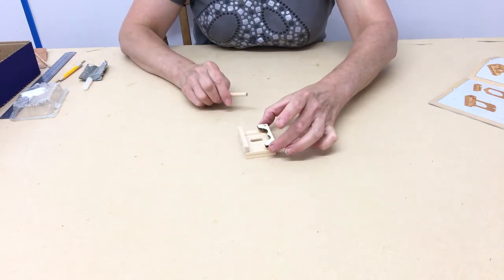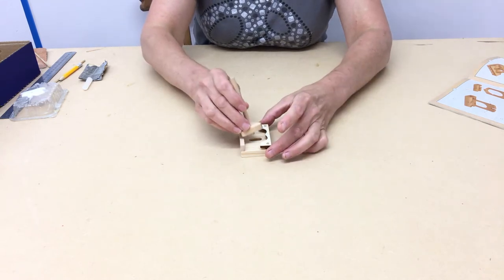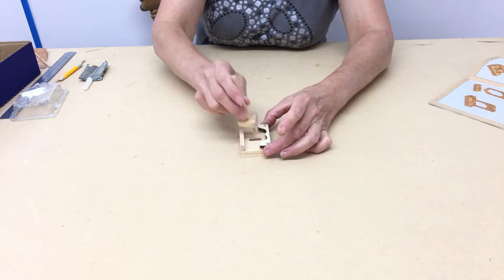Then hold, but don't glue this part roughly at the end of this section. And put a piece of 6mm shaft — one of the pieces that you've been supplied with, it doesn't matter which one — through the triangle cam into that groove.